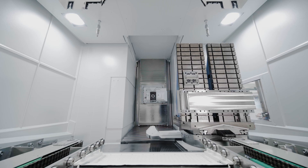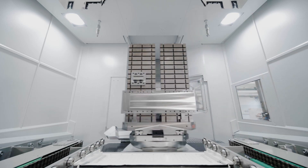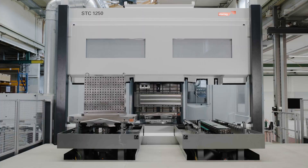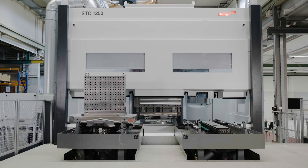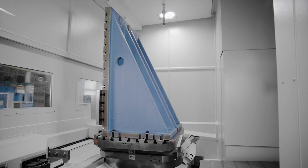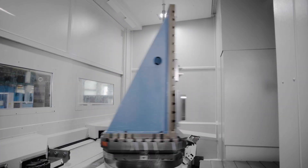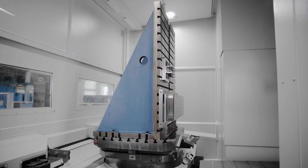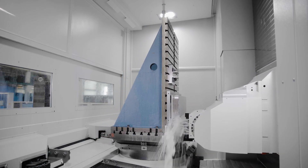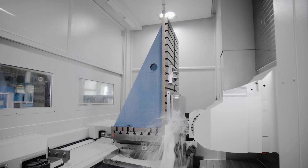When you're tackling hard materials and removing material at such a rate, how do you ensure tolerances are being maintained? You can have probing cycles, but probing cycles are not cutting chips. Typically you rely on the machine accuracy and performance to produce good parts, and you would measure the parts offline on a CMM.